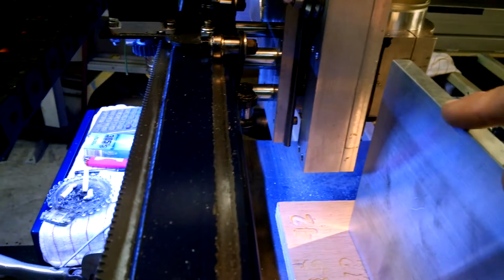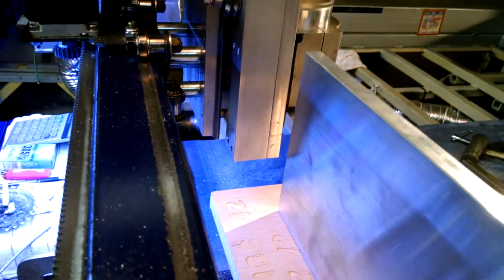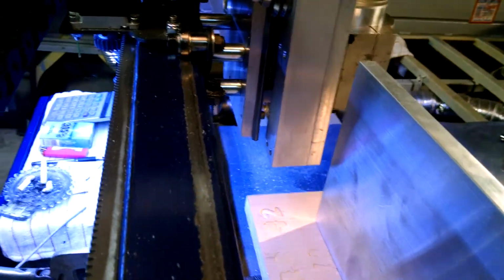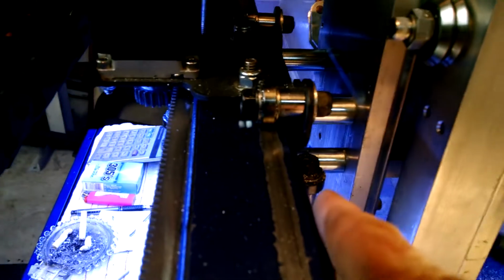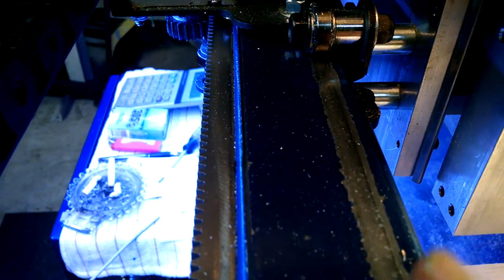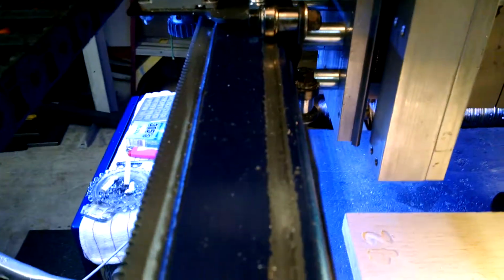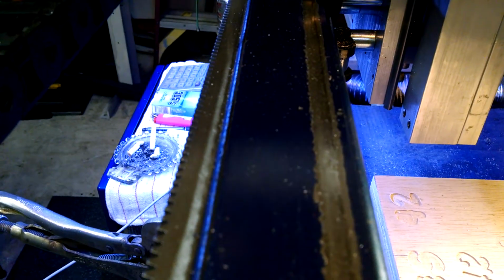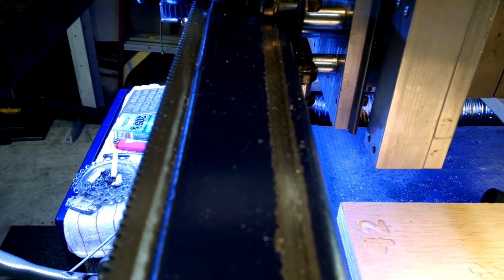So essentially we're going to use this for the carriage, or some parts of it. It's not going to be that tall. It's just the stock that I had here. So I'm going to put a piece of 1/2 inch plate laminated on the side of the gantry that's here now, and I'll mount the V-groove track on top of and bottom of that 1/2 inch plate, and then the carriage will mount to that.